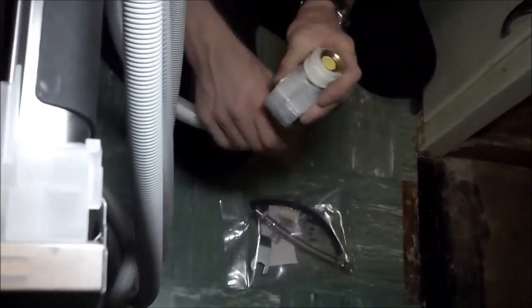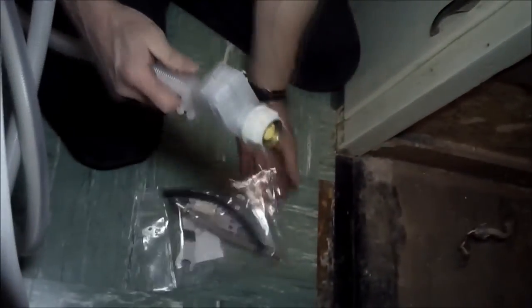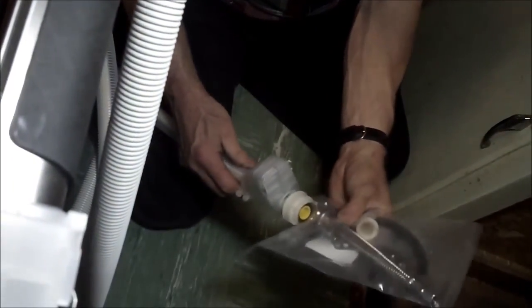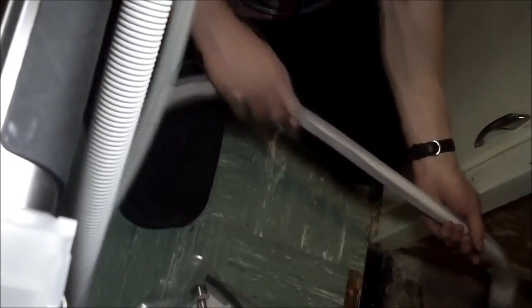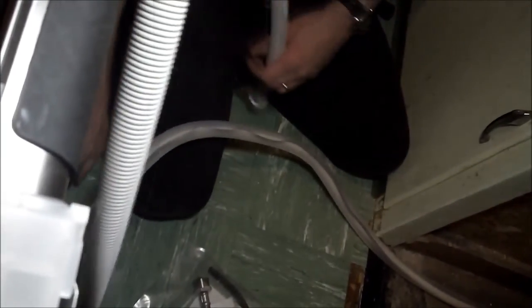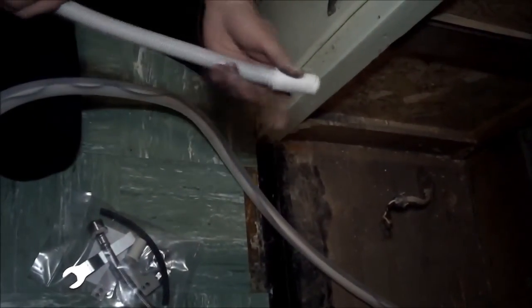this stuff all downstairs, and they've got an adapter here to connect between the water supply, and it looks like there's a solenoid inside of here. Okay, so this is going to connect to here. Looks like a regular garden hose connection. From what I can see here, this is going to have to go right through the hole. And then this water drain will have to be somewhat similar to that. But we'll have to tend to that when we get to that point. This would be the drain. We want the drain to go down the same hole, so we'll have to enlarge that hole significantly.